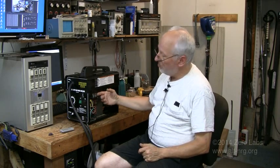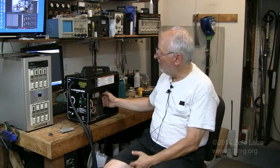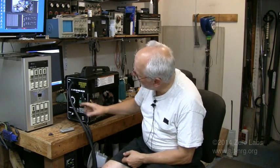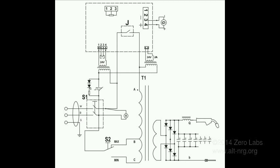The only other thing I'm going to do differently: the secondary voltage drops from a no-load voltage of 24 to 28 volts depending on the range selected, which also affected motor speed. Now with the conversion, the motor speed is unaffected by the range you select. But because the 25-volt secondary caused me to run the speed control down around two when I used to run it at four or five, I'm going to switch to the 12-volt tap on the transformer for the motor drive. That should get me back into the same calibrated range as before.